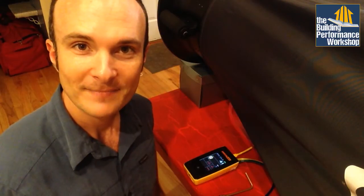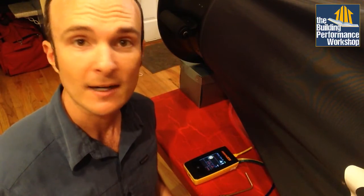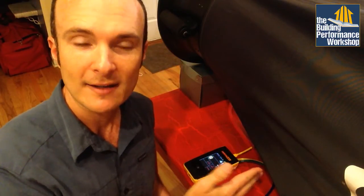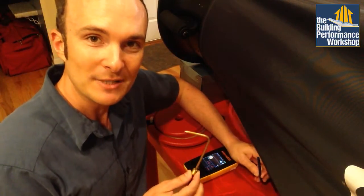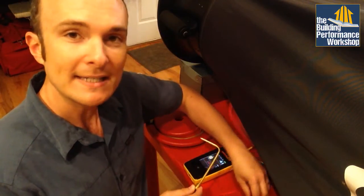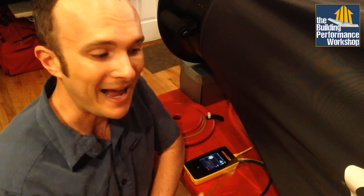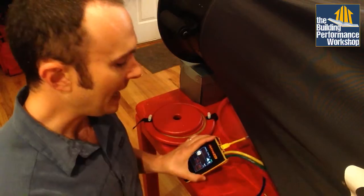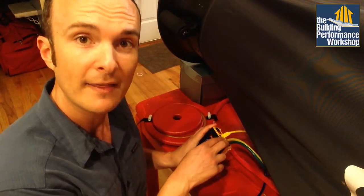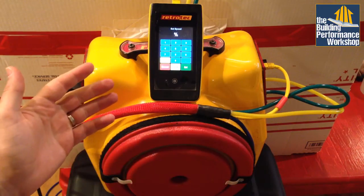This is not a calibration that will replace the manufacturer's calibration — I want to make that perfectly clear. The turbulence introduced by my testing fan is very specific and not exactly like what a register in a residential or commercial setting would produce, so I want to use a grain of salt here. I'm not using the A side of my manometer at all — for this test I only care about airflow, so only channel B is measuring airflow.